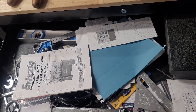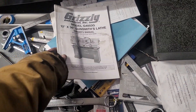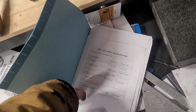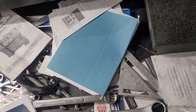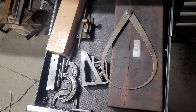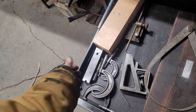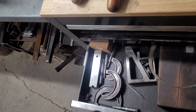I keep wrenches and manuals with my surface plate in this drawer because I don't have a better place to put a surface plate. I like to keep the manual around for the lathe. Another thing I learned: keep a drawer with your most commonly cut threads so you can get all your major and minor dimensions — it's a lot easier than trying to remember them. My backup measuring tools and gauge blocks are here. I think I have about 15 spare micrometers. That's a sine bar — I'll do another video on that. It's for setting really precise angles on the mill.